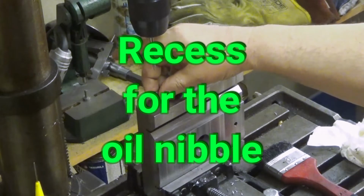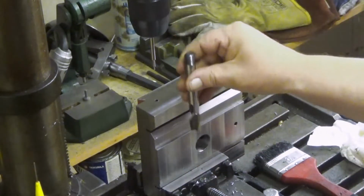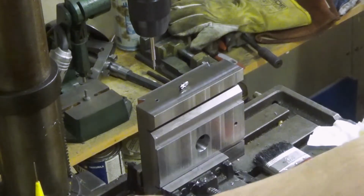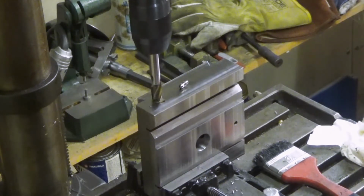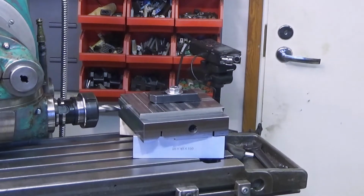I don't want there to be a thing like this sticking out from there. So therefore I will use this milling thing to cut a 10 millimeter deep hole, a recess into there where this then goes. So, well, a milling thing in a drill chuck, well, let's see. Aha! Damn. Well, here it is now in the milling machine. Hopefully it has more rigidity than the drill press. A drill press is not a mill, that's for sure.